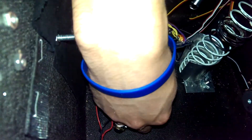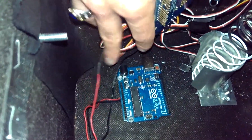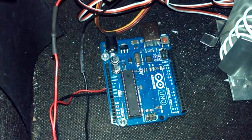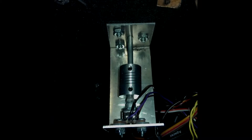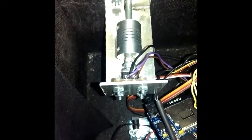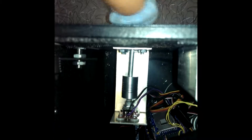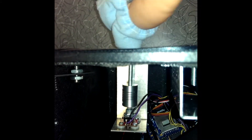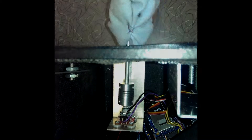The power from the barrel jack is split between the Arduino and the servo shield, providing a separate supply to power the motors. This protects the Arduino from excessive current or transients from the motors. The encoder was attached using a shaft coupler. A rotary encoder generates interrupts when the crank is turned, and the speed of the music changes depending on the time difference between interrupts. The music plays at a pseudo-random interval from 5 to 10 seconds before the jack pops up.